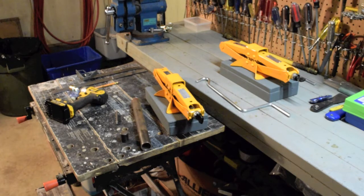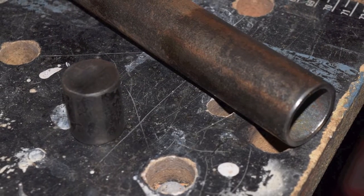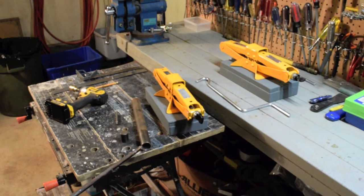To do that, I've got some one inch solid round here and I've got some pipe with one and one-sixteenth inch ID. What I'm going to do is take this piece of one inch solid, cut a slot in it so it fits over here, and then I will weld it into the center of this pipe and the pipe will sit up on there.